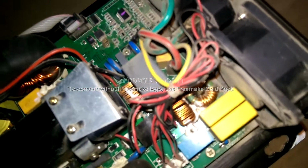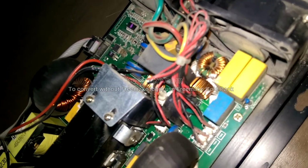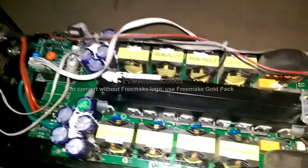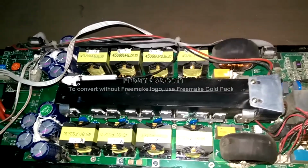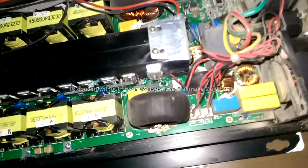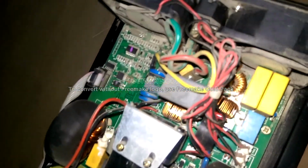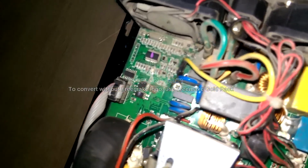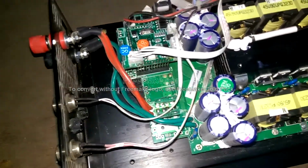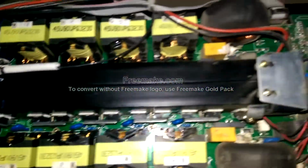So after inspecting it, everything seems clear. And again, I would like to highlight, once I connected this inverter again, I realized the power would jump to 9 amperes and then would trip, which basically indicates a short somewhere inside it, and I don't know, it seems like a burnt part. Let me know how I can diagnose the issue, or any other component which the viewers or experts would like to see.